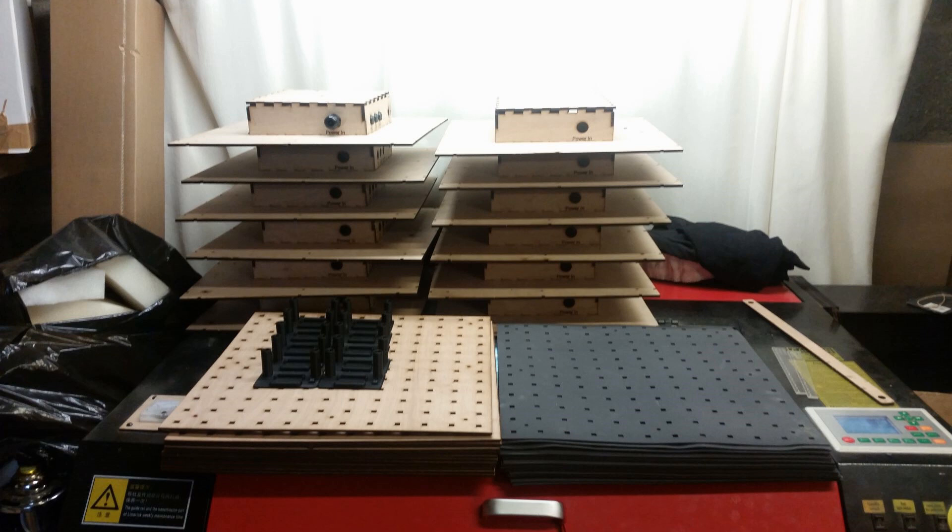The biggest difference is that in version 1 my plan was to have them running off 24 volts and then have a step-down inside, but after I sat down and worked out the loadings and all the rest of it for the power supply needed, I scrapped that idea and went with mains power. The back panels ended up being bigger in version 2 than version 1, but the principle of how everything locks together is very much the same.